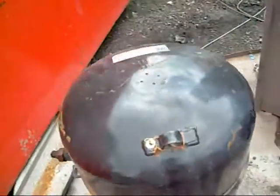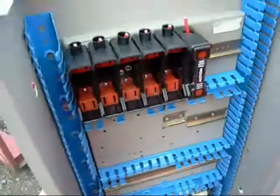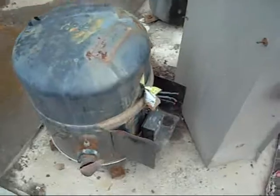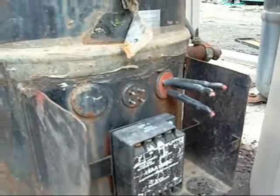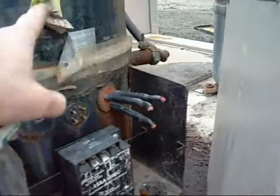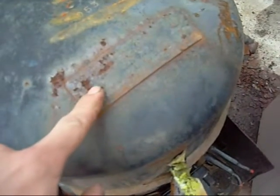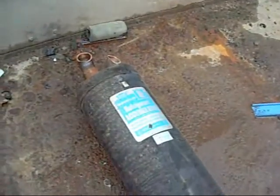With a bit of luck I'll get time to strip these down in the next week. I believe they're a reciprocating compressor — they don't appear to be a rotary design. All the controls have been stripped out, a couple of nice fuses. These compressors are built by Bristol USA. There's a Texas Instruments Overload Protector that just plugs in up here. These are the main three-phase wires — all three phase obviously. I'm not sure what current they're rated at: 380V, 415V. And 141A LRA. There's also an old TACUM Refrigerant Accumulator.